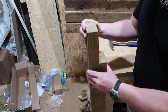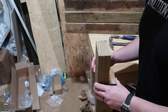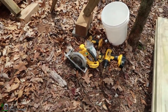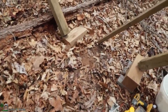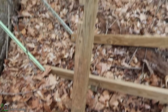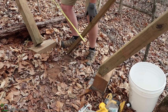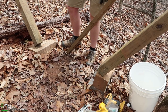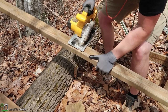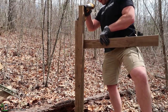I'm going to continue to cut these two notches on the other three posts, keeping in mind where they're going to be. If this is front right, this piece goes out and this bottom piece goes this way, so the next one needs to have this piece on the back and this on the side. After several trips hiking up this hill, I have my materials ready. I've placed all of the 4x4s in the corners they're supposed to go in, and now it's time to assemble. I've measured the distance between my two base pieces and determined that 35 inches is a good distance. To make sure this 2x4 stays where it's supposed to be, I'm just going to sink a 3-inch screw in here.